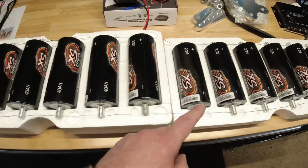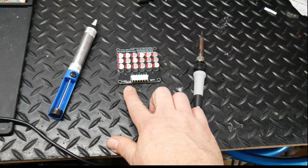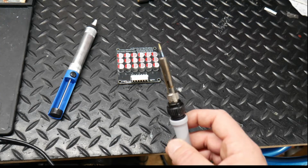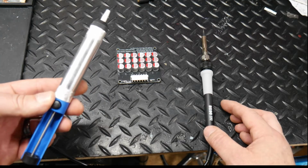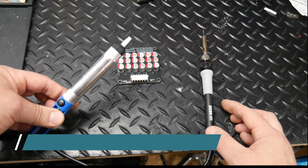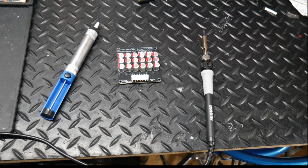Alright guys, so what I talked about earlier, we're going to desolder the center to the right pin, and we're going to solder the left LTO to the center pin. When you use a soldering iron, use a very small tip because these pins are super small. Use, if you can, a cheap desoldering gun. I'll put a link below for a cheap good soldering iron that I used to have, because I know a lot of guys buy this kind of stuff once, so you don't have to buy something expensive. So alright, let's get going and I'll show you guys how to do it.